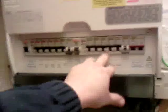The idea of the dual RCD distribution board is that the sockets and lighting within a two-story or three-story property are split over the different RCDs. For example, your ground floor sockets ring main will be on RCD number two, and your ground floor lighting will be on the opposite RCD. The science behind it is that if the RCD trips under a socket fault, you still have the lighting powered on the second RCD. If there is a major fault and the supplier's 100-amp cutout fuse goes, the entire distribution board will be rendered powerless — but that is the science behind 17th edition split load consumer units.